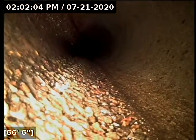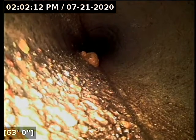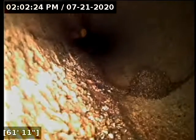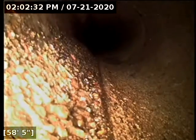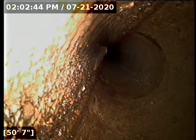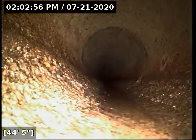There are a couple joints in the concrete pipe that have some substance sticking through them. The hard part is telling the difference between whether it's dirt or pipe grout — they look extremely similar to each other. In my opinion, I've got to see a couple more signs, like water dripping through the pipe or earthworms crawling around. But this is not an issue affecting functionality, flow, or anything of the sort, and it's not letting sewage escape the sewer line. In the worst case scenario, during a heavy rainstorm when the ground gets saturated, you can end up with some groundwater dripping through the pipe. But unless I can catch that or have really obvious signs that a joint is truly open to the ground, I do not recommend repairs. I don't like to recommend repairs on things I can't confirm with certainty.